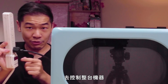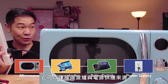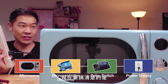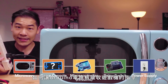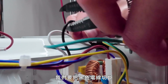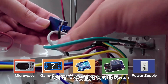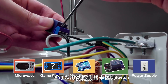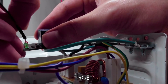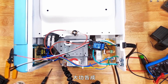We can now control this entire device with one simple input/output. If we use an Arduino to control our own relay connected to the power supply going into the microwave, then we have a really easy way of controlling this thing. Now all we have to do is figure out how to get the Arduino to listen to the game console. This is where the power comes into the microwave from the wall — a white wire and a black wire. We're going to cut this black wire and attach a relay, an electromechanical switch, which can be controlled with a microcontroller. We put on three lead wires — this is going to go to the Arduino to control the relay and the microwave. Bob's your uncle.